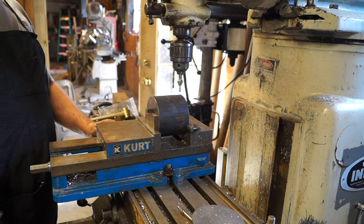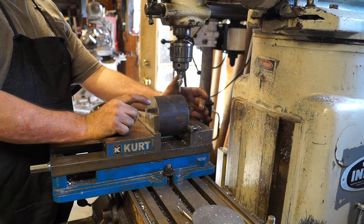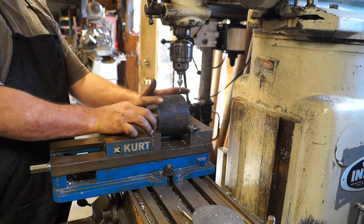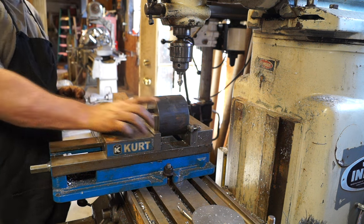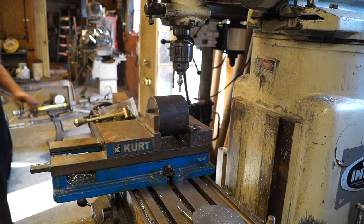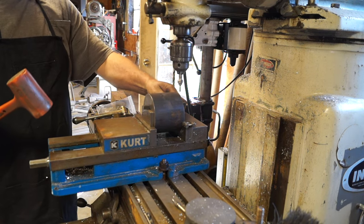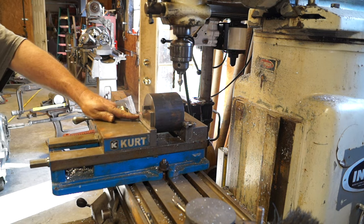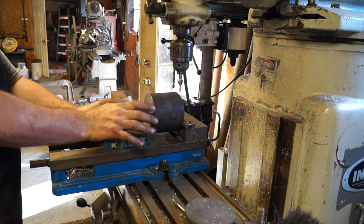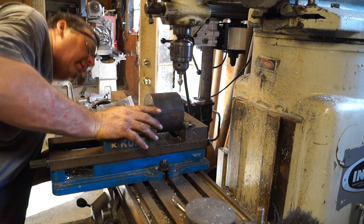All right guys, so our next setup, we've keyed the pulley, and now we've taken a piece of key stock and let it stick out both sides. We've got it sitting down tight. We need a dead blow and to tap it down a little bit. Anyway, we got it sitting on a couple of Jo blocks. These are sacrificial Jo blocks, and we're using them for parallels. So we've got it set up, and we make sure everything's right.